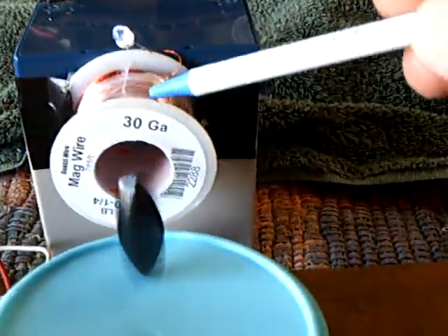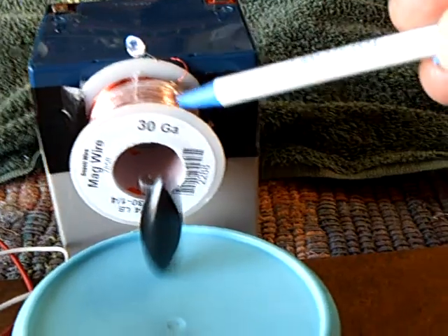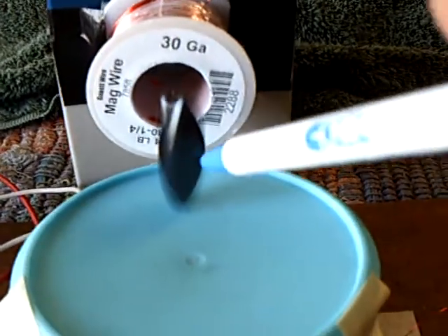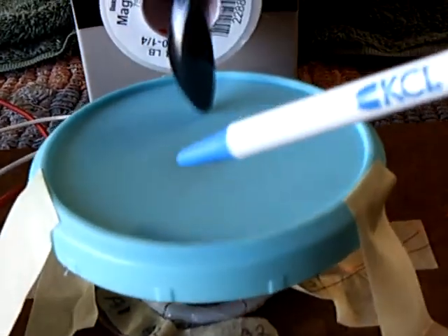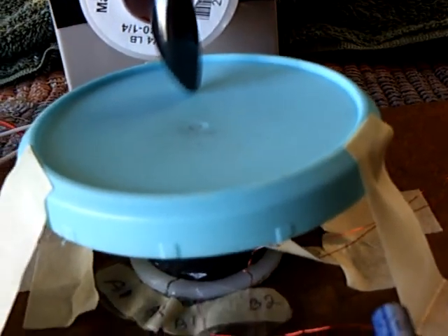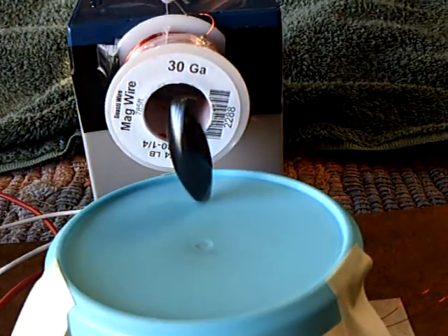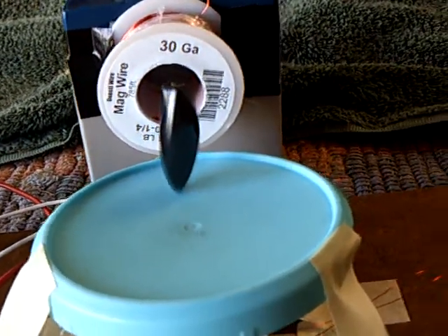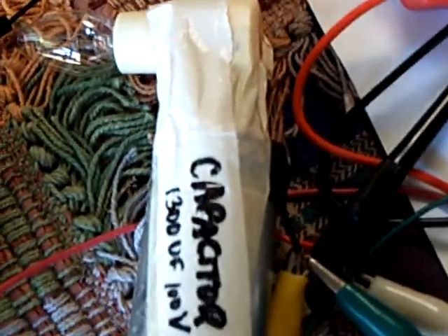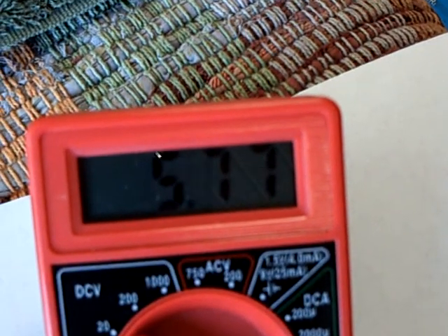I've got an LED lighting up off of it now. That's an air core coil — just a roll of 30 gauge wire I got at the store — hooked up the LED to it and it works quite well, generating electricity off that spinning magnet. I found that if you tilt the lid a little bit and get the magnet running down away from the coil center, it does better down there. Wobbling around doesn't seem to hurt anything or cause a problem.